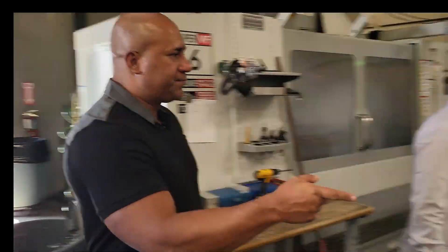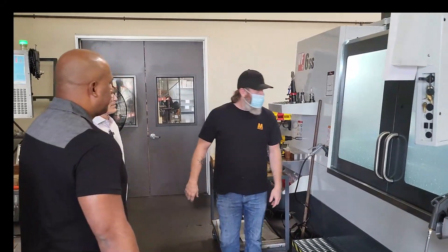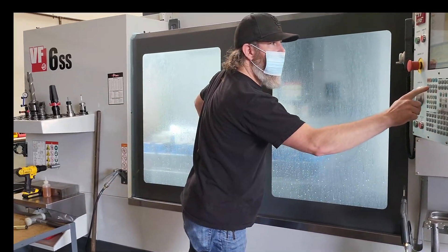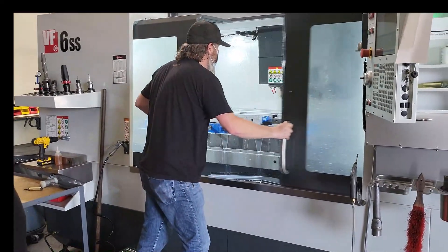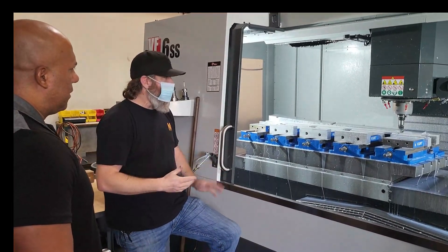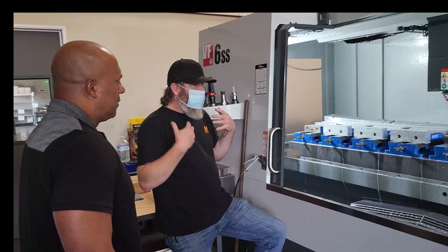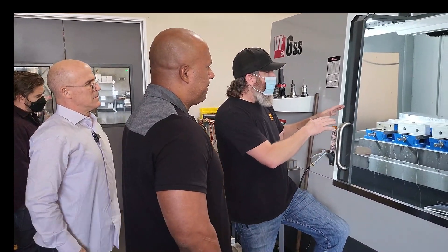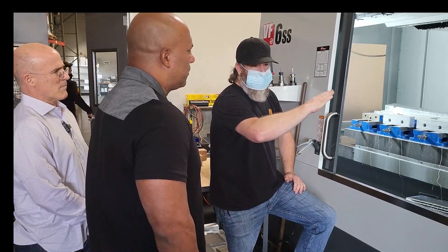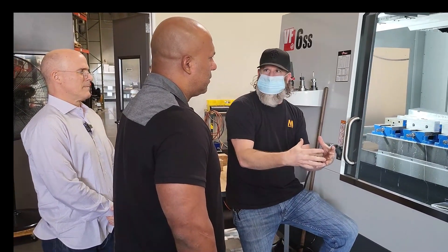So this is what's happening here in this machine — it's another machine just like that. What are we doing here, Andy? Right now we're making a fixture. You can actually see that. So we're making a fixture — I'm going to pause it real quick. Look at that. So this is going to be a fixture so we can cut some angle holes. Normally something like this might take a fourth or fifth axis machine, but we're doing what we can with what we got. This fixture is going to mimic putting a flat part down on the table, angling it this way and that way to get the hole to go straight down. So that when the rods go in, they're going to go in at the right angle when we pull everything together while building it.